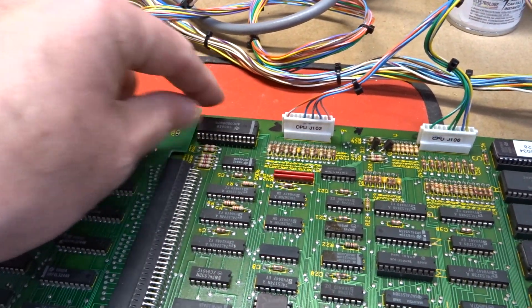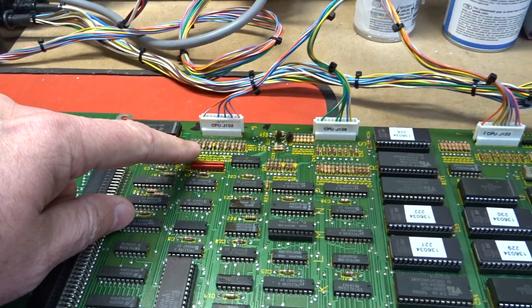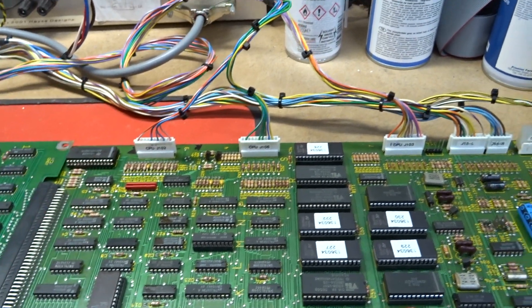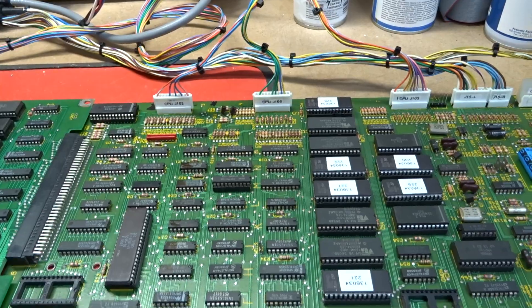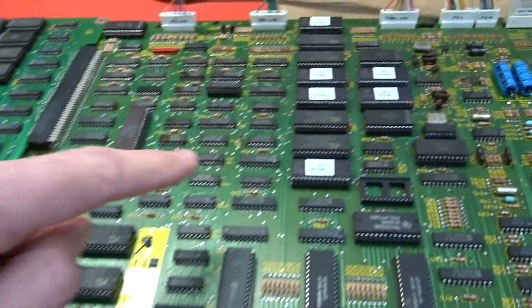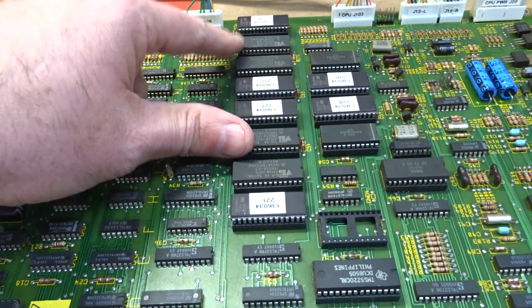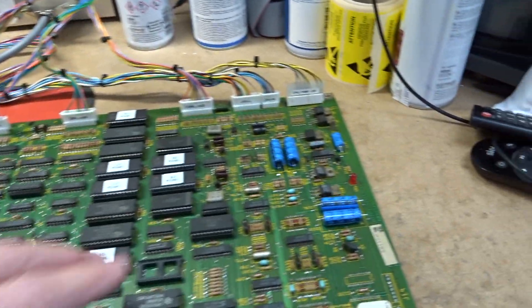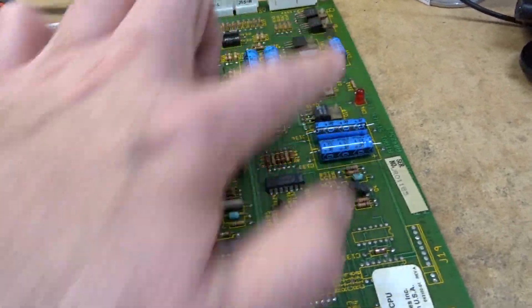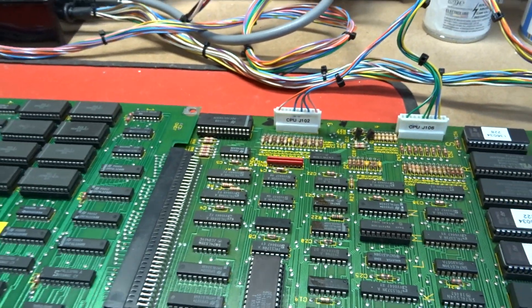The socket was a little bit wobbly on the ADC0809, so I've changed that as well. I didn't like the look of the resistor arrays, so I've changed those out too. The other thing is you had the first version of the firmware running on this board, so I've put the later version — revision two — firmware ROMs in. These ROMs are okay and they don't change between the revisions. Lastly, caps are done, and all the edge connectors have been replaced and changed out as well.